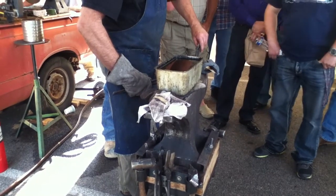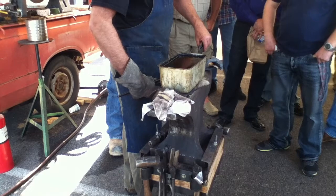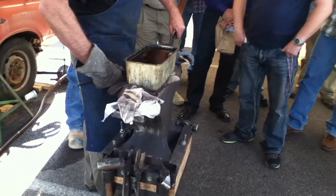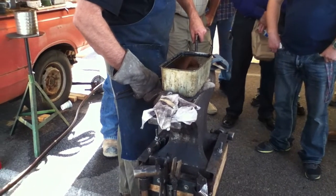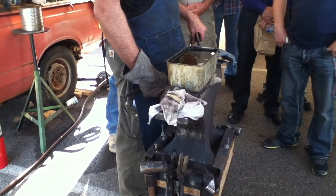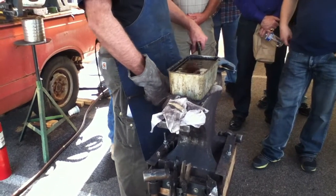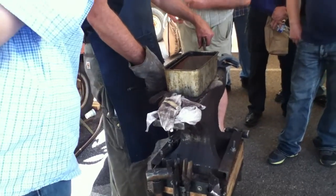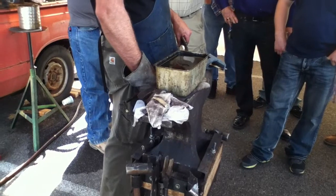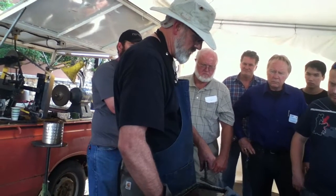Sure, I'll bring some hot tongs so we can do it with the hot tongs. I may have to catch it up with the torch. Now, if I'm interested in playing with it — I'm going to bring that around to the back because it's thin and a little tighter at the spine. I want that purple color to go all around the spine, and a dark straw to carry along the edge for hardness. Those little black pits on the knife are from crystalline pop-out — it was too hot on the initial quench, and the crystals pop some little bits of metal out, kind of like scale.